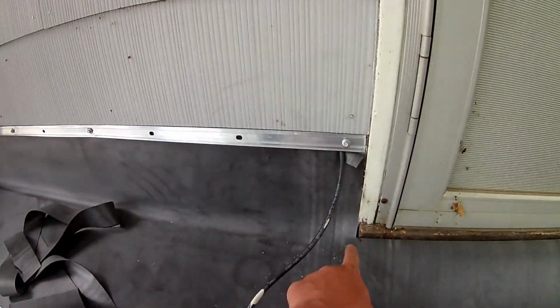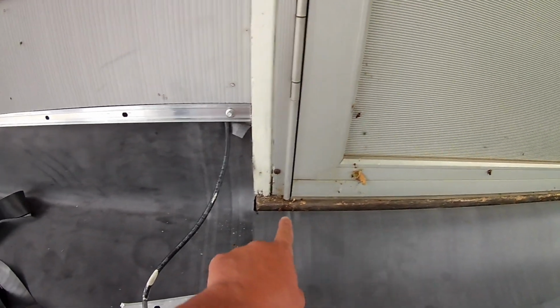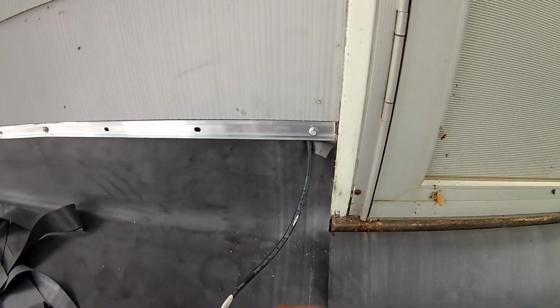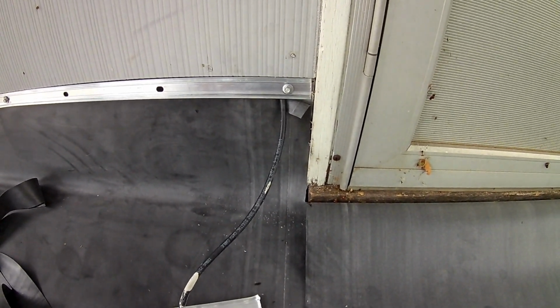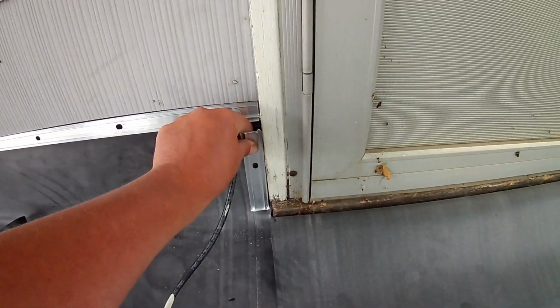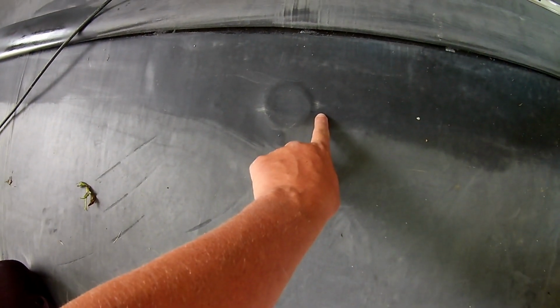Then we'll have termination bar here, and there'll be water cut off behind all this, because this is just a goofy leak spot right here with these doors, and they're only 1/2 inch off the deck. So these spots are always tough, and people usually mess them up. We put water cut off behind there, and then there'll be a piece of termination bar here and here. Paul is cleaning it, and Dakota is priming it, and we always mark our lines with a pen. It's hard to see, but that way you know where to put your seam tape.